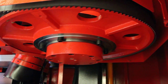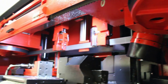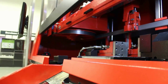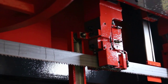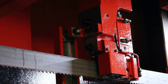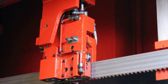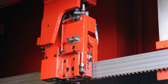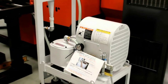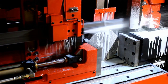The machine has a zero-twist blade frame, which greatly reduces the stresses on the blade, allowing for much more aggressive cutting without blade breakage. Notice also the massive structure supporting the blade. Hydraulically actuated blade guides constructed from heavy casting create a rigid supporting structure. Coolant is plumbed directly into the blade guides to ensure adequate supply to the blade at the correct location. The high-pressure pump supplies coolant with enough volume and force to properly lubricate and cool the blade during cutting.